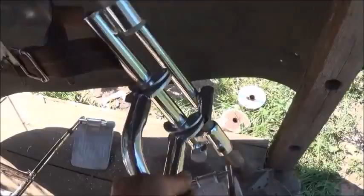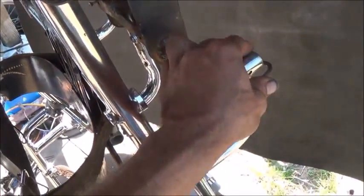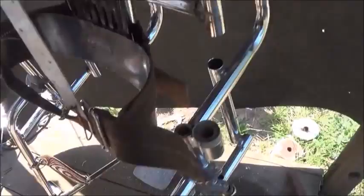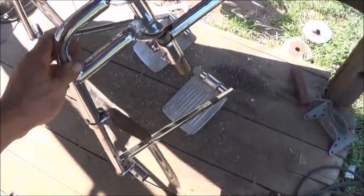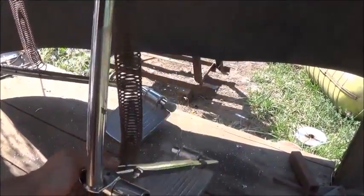That gives us our hip swing so we can swing out the hip. That double-pivot position basically allows this simple hip almost an entire free range of motion — incorporated with, obviously, we still need a knee here. I've got springs to help bring the leg back up right now, which gives me a little less energy required to walk it around.